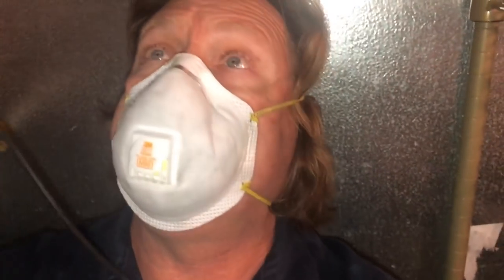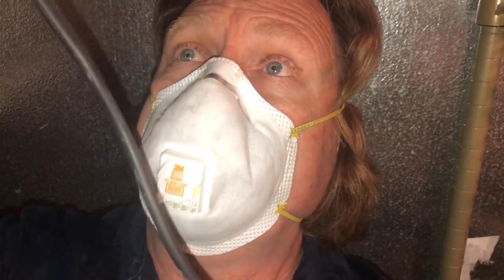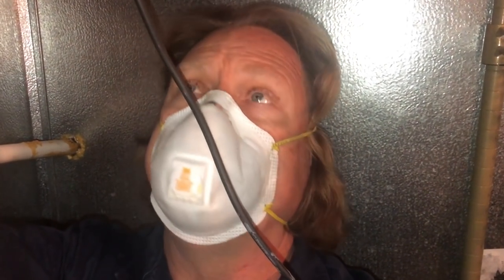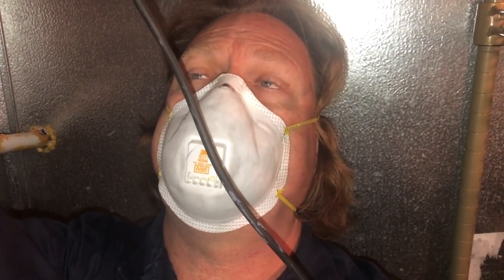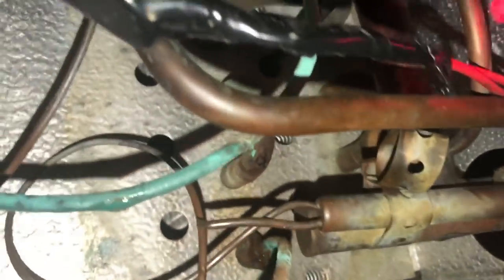So like I was talking about on the roof, on an H-10, it doesn't have logic where it sees refrigerant and just goes rah. It sees a little bit of refrigerant and then it starts to uptick. Now if it's a big leak, it's going to scream at you. A lot of those handheld leak detectors are just going to scream right at you on any detection. See, there you go. That's getting bigger. I was able to get it. So on that return bend is the leak.